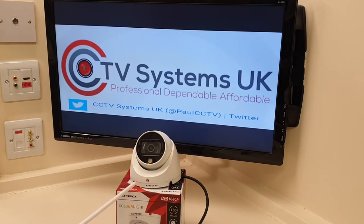The reason I've grouped the metal case and retaining screw together is that the standard HikVision 'Colour View' camera — as opposed to the S Pro 'Colour Night' — has a plastic case and no retaining screw. Their night-vision cameras do have retaining screws and metal cases, but not the colour view model. HikVision said they went plastic so it wouldn't cause issues on plastic fascias on the outside of buildings — an excellent argument, but we'd choose the metal one every time.